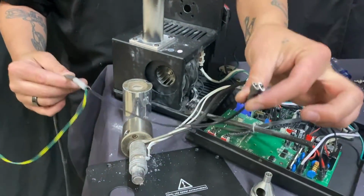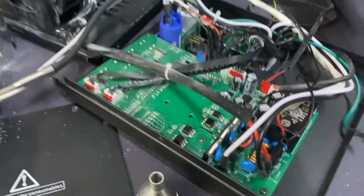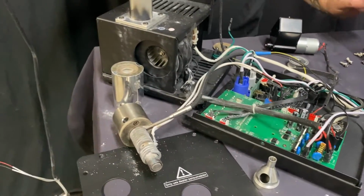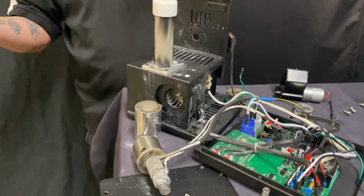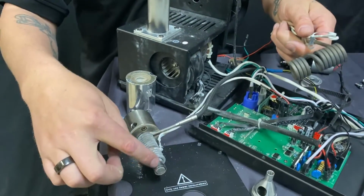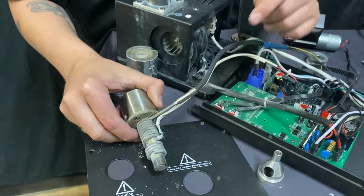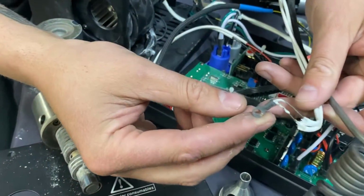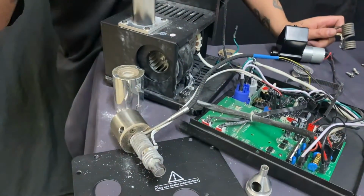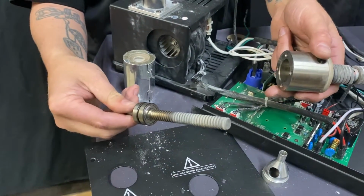Anyways, these two pieces to the heating element are actually what connect to the board. Specifically, those are right here on this board. So you have 1 and 2. Not every board is going to be like that. Okay, make sure you have the proper tools and the proper gloves. This heating element, as you can see, literally just wraps around this post, if you will. In order to get that off, you have to take this screw off, which is the temperature sensor that is right here. Do not lose the 2 washers there. If there's 2 washers underneath that screw, if you lose those washers, that screw goes in so far that the internal part of this, which is this, will hit those screws and it will not work.